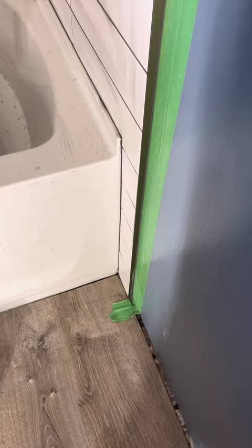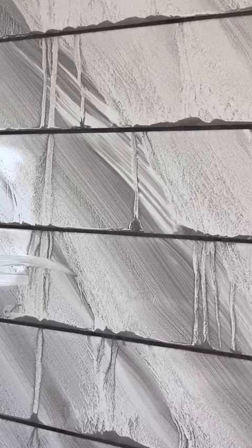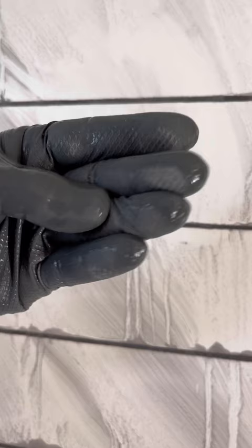Just like before, between the first wash and the second wash, we're going to give the grout a little bit of time to set up before we wash it a third time. As soon as the grout is dry to the touch on the surface of the tile, grab a new sponge and a clean bucket of water and wash it again using the exact same technique as the second wash.